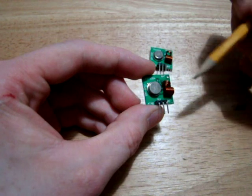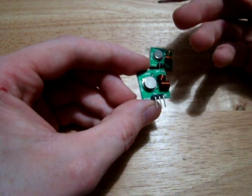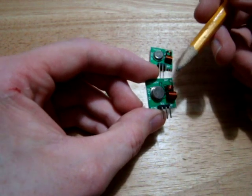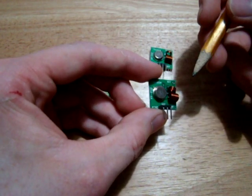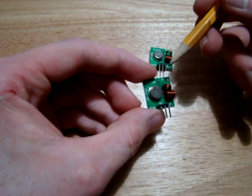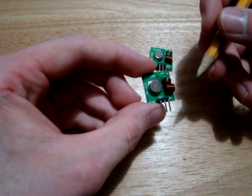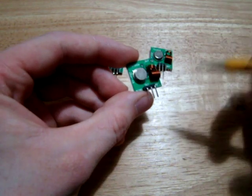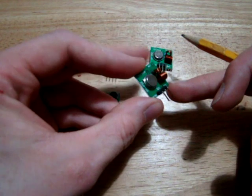So the microcontroller knows that it has received a full byte, it sends that full byte. You can put in controls so that it even gives a signal to say that it's received the byte successfully. You don't need to do that, of course, and we don't do that in the RC tractors because it would require more pins, and we kind of want to use all the pins of the Arduino for functions on the tractor. But this could lose the signal, or the signal could become distorted.